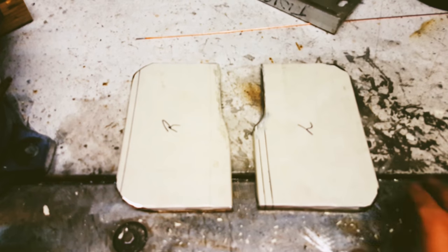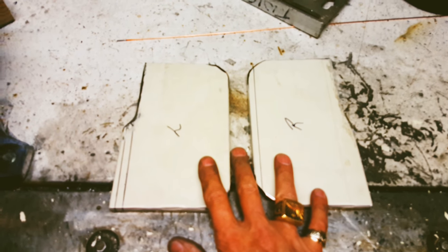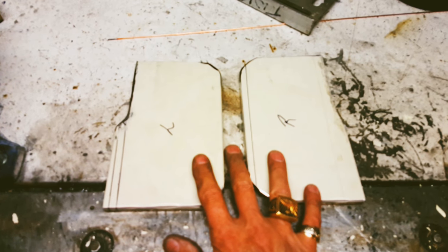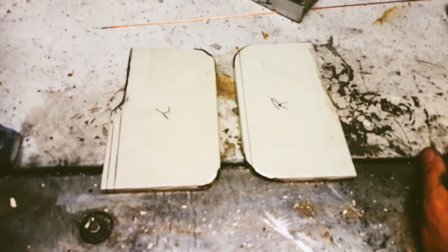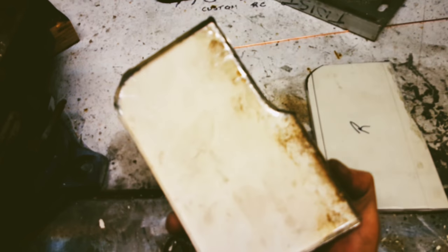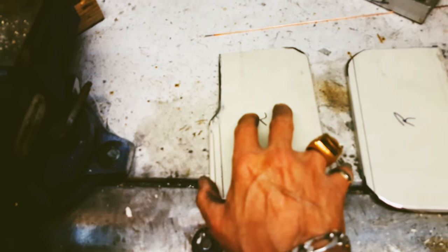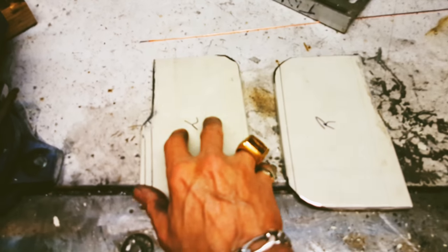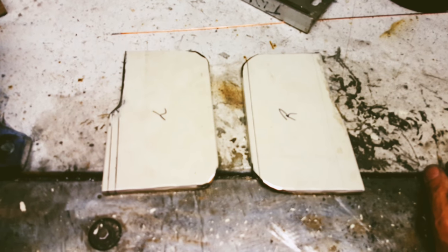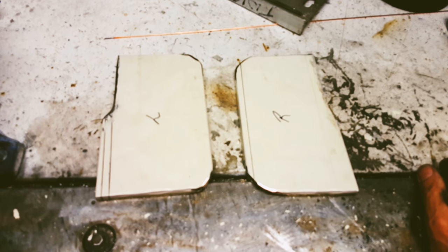There are the doors made — left and right. They fit the cab rather well; it's difficult to show you right now but you'll see them when they're mounted. The doors are the same as the cab — made out of 22-gauge steel — and as you can tell by the back side, just bent on the metal brake, with some of the curves done by hand. Both doors are made. All we have now is to cut out and form the pieces for the left and right rad support, get those welded on, and that'll complete the cab. Then we can go to work on the sleeper.